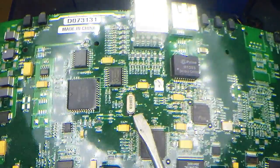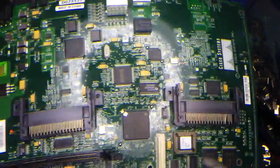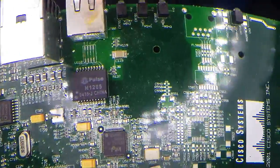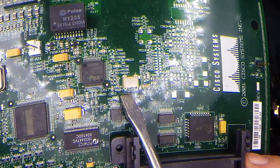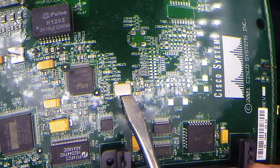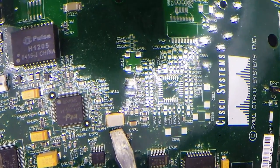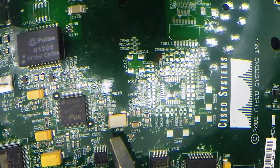Here's another good example — you've got your crystal here on a telecom modem board, a Cisco board. There's your little crystal — it's just a flat one. And here is a crystal oscillator. You can see these crystal oscillators are different — I keep these separate. They've got the little gold band around the edge. So inside there will be a little bit of silver, but it's also got a gold band and on the base they're like a ceramic kind of thing. I keep these separate — these are more towards gold recovery than silver recovery.